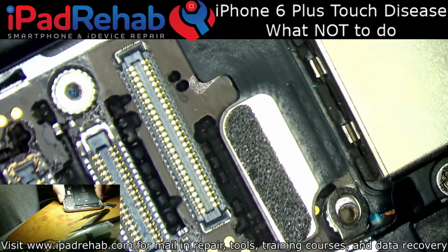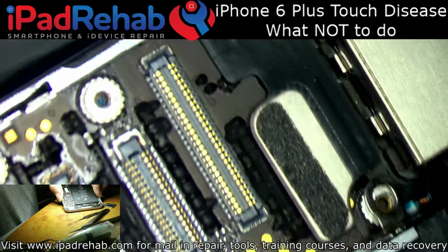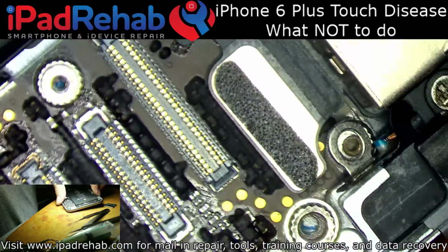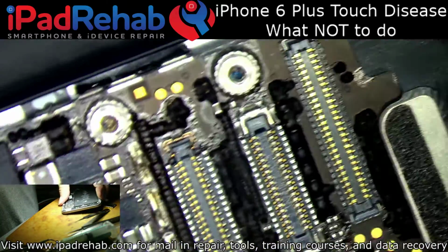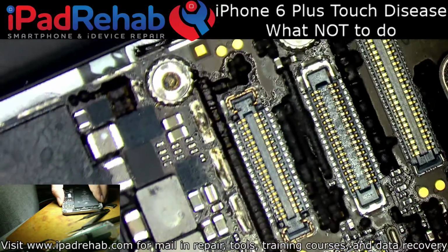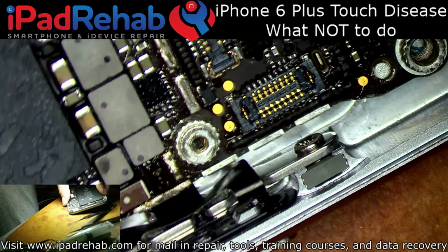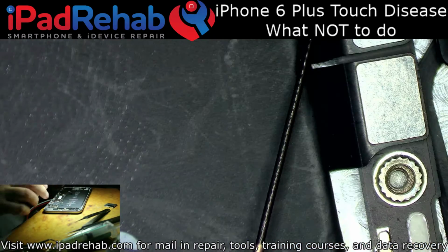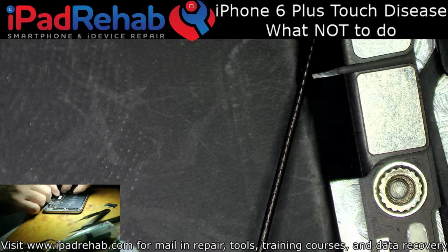Check for any bent pins in the digitizer connector. Check for any corrosion around the pads of the pins in digitizer connector. Don't find any problems there. Check for long screw damage. No long screw damage. All right. Well, we're narrowing down our list of possibilities.